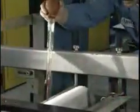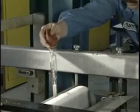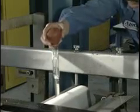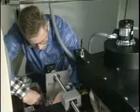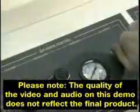In addition, check the specific gravity of the flux. Specific gravity is the way we measure the percentage of solvent in the flux. You could think of it as the viscosity or thickness of the liquid flux. Now we make sure that the flux air knife is set at the correct angle. That's because the air knife is removed during cleaning and may not have been returned to its proper position. You should also check the air pressure.